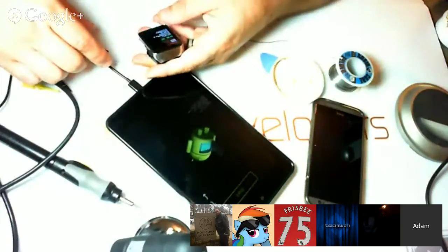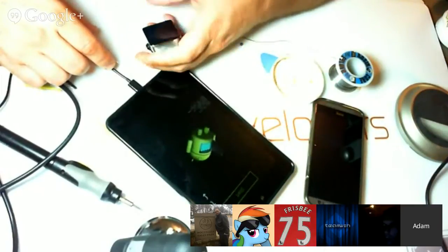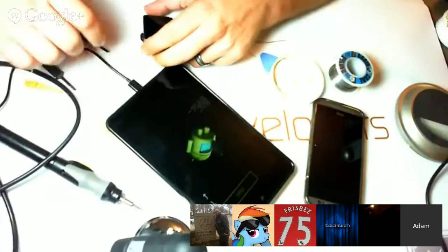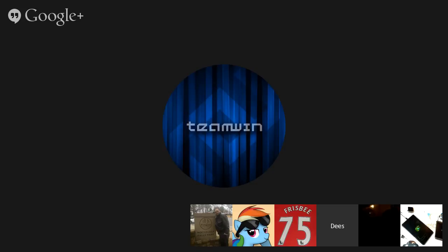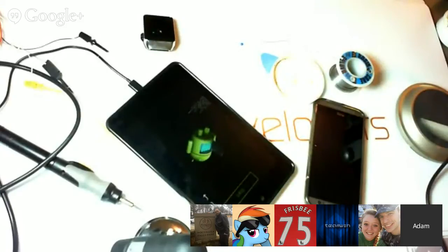This watch is getting very, very hot in fast boot mode. You said it had that menu where you could swipe up and down and all that? Yeah. It's probably pegging the CPU. Probably. You're right. That's exactly what's going on. It's just sitting there wasting cycles.